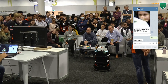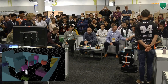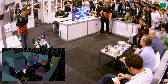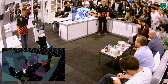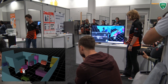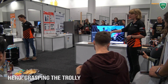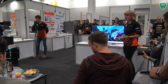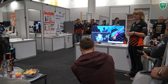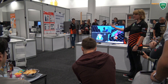Okay, so now after this we have detected our guests, and our robot only has one arm, so it's going to grab the tray over there. Now, I would like to draw your attention to this green outline over here — that is our robot footprint, which is basically the part of the robot that it uses when navigating, so it knows its own size. We are actually able to dynamically update this. As you can see now, the robot footprint has actually increased to the right size to account for the tray, and we've visualized that it's actually taking the tray.